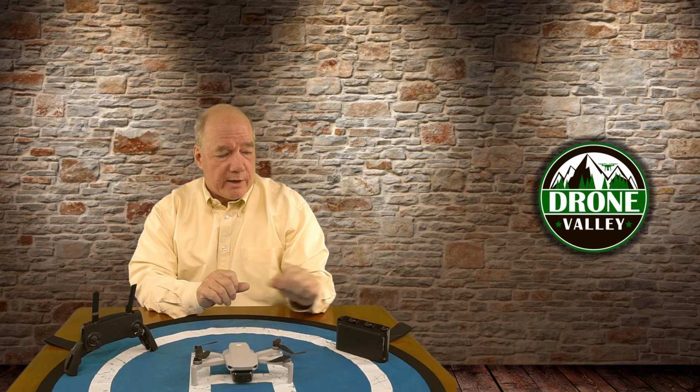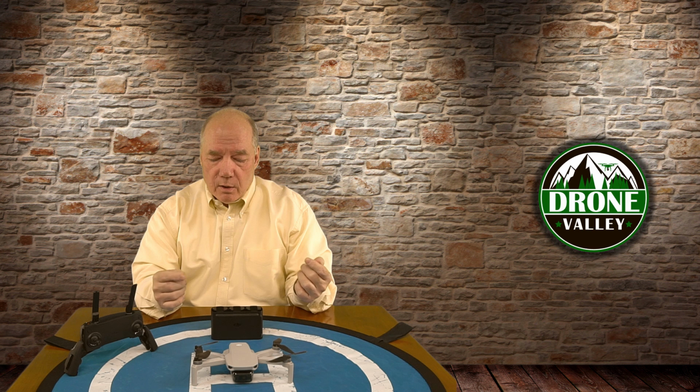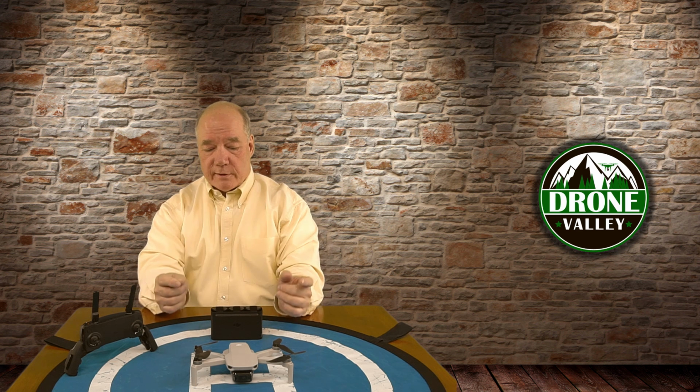Another thing when you're outside, we'll talk about the batteries next. Batteries behave really weirdly in cold weather because the chemical reaction that takes place inside these batteries is supposed to be done at room temperature. When you get colder, all kinds of weird things happen. And the two things you're going to notice with the batteries are, number one, you're not going to get as long a flight time out of it, but more importantly, the batteries, as they get colder, are going to start, we'll call it rundown. They're going to start decreasing in their charge a lot faster, and it won't be linear,